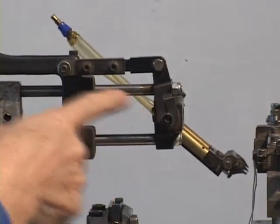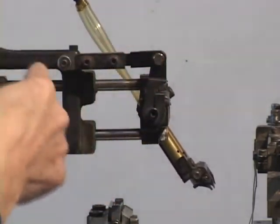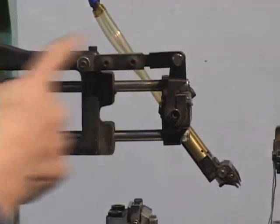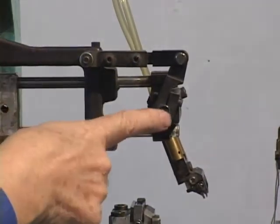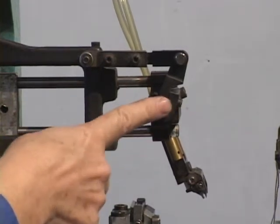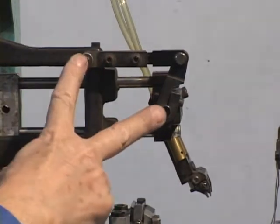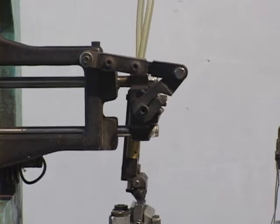That rotary motion is induced simply by the fact that this four-bar linkage, actually a dyad, which if you include the other two pieces of the system would make a four-bar linkage, but just look at this dyad right here, one end of which is attached to the horizontal slide, the other end of the dyad is attached to the vertical slide. So it's coupled between the two.